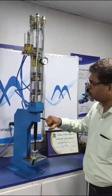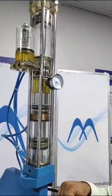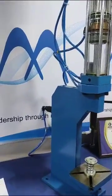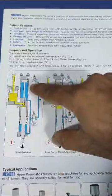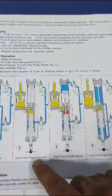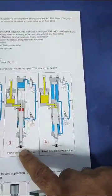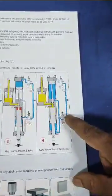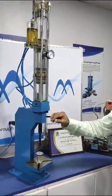There are four positions of the hydropneumatic cylinder. First is the start position, where both the output piston and intensifier piston are at the home position, and the reservoir piston is also at home. Second is low force rapid approach. Third is high force power stroke, where the actual force is applied and the job is done. Fourth is low force rapid retraction, which begins once both solenoids turn off.